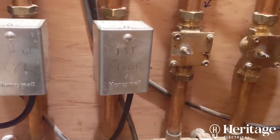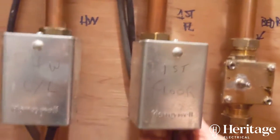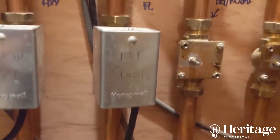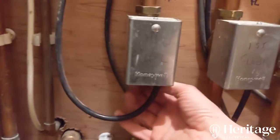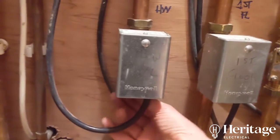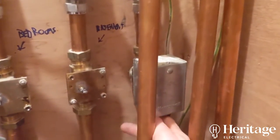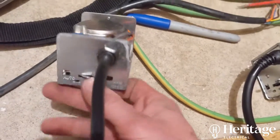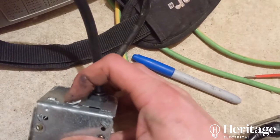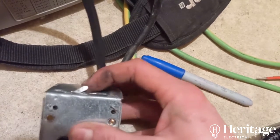Can you hear that? That's me manually opening and closing the valve using the little lever underneath. These make that sort of winding sound. This one, even though the heating's off, there's just nothing — no resistance there at all, so there's something up with the hot water. Same with the wet room down here — that doesn't sound very nice at all. This one we've just taken off; the little lever is totally bent out of shape and it just won't let me open that valve.